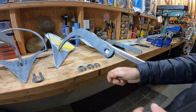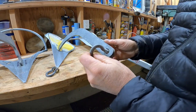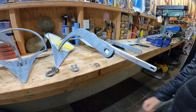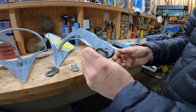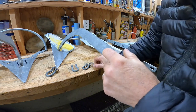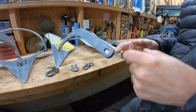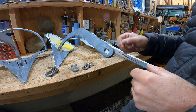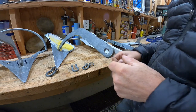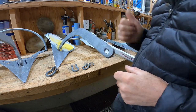Here's a 21-pound Spade S60 anchor. The 7/16ths shackle doesn't even come close. The 3/8ths is not a drop-in — you have to get it just right, and then it'll pass; once it's through, it doesn't bind. 5/16ths passes no problem, as does the quarter inch. The hole is not chamfered. Galvanizing is hanging in there — I don't see anything knocked off. I bought this anchor second-hand earlier in the year; it was virtually unused. I've jerked it around quite a bit and the galvanizing is holding up on the hole. Good slot.